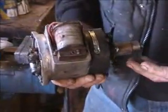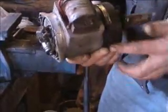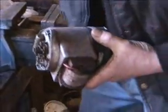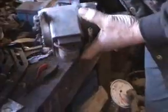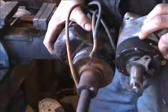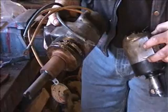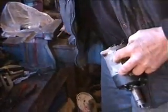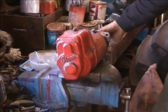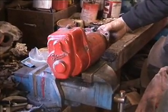They were designed for some sort of ex-army machine, but they are brand new units. So you actually swap the bottom unit for this one. You can actually see the difference there, can't you? You actually swap that shaft for that shaft, and you've a brand new VR4 Lucas Magneto. You can have these reconditioned down at Wood Auto Factors, which I might do as time moves on, because I think original units will be hard to come by.